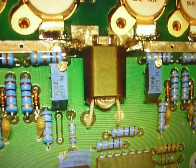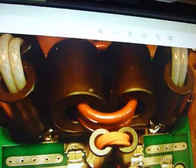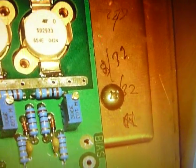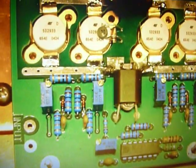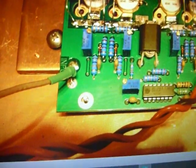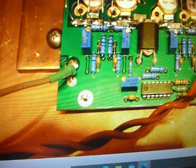There's another shot of the amplifier itself. The power comes in through that little transformer right there and goes out through that big transformer on the back. You can see I made a lot of notes in there — threaded for 8-32 down below and things like that to help me with assembly. By the way, if you make marks like that and want to remove them, just put some alcohol on a little rag and you can wipe off a permanent marker very easily.